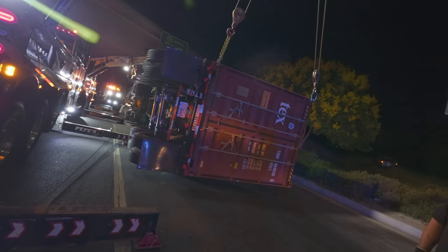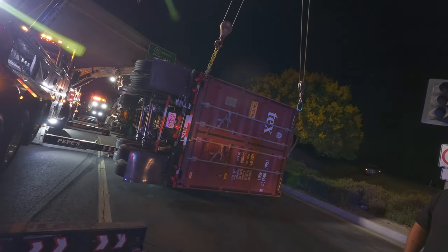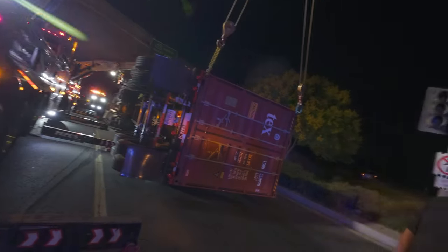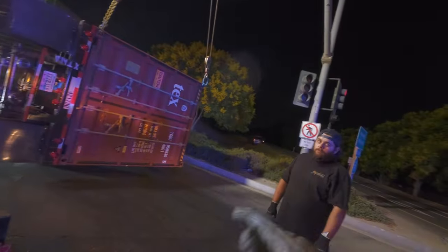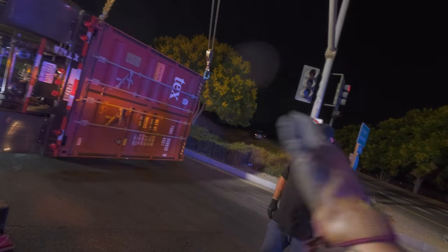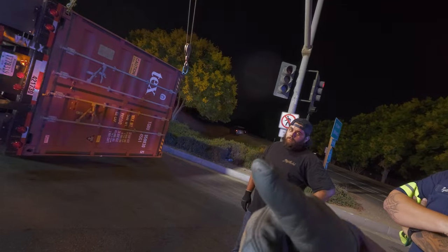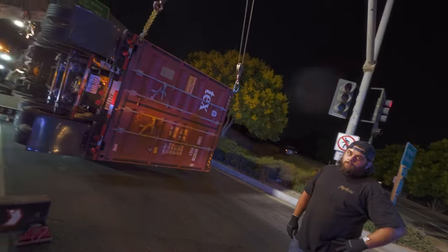When you want to roll, are you better to have your boom straight off your truck, or at an angle like you are right now? The strongest point is going to be towards the back at 30 degrees on the rotators. Off the side, square with it, perpendicular to the truck, is strong, but it's not going to be as strong as being to the back, because you have all that leverage of the truck length. Okay, so that's what helps you.